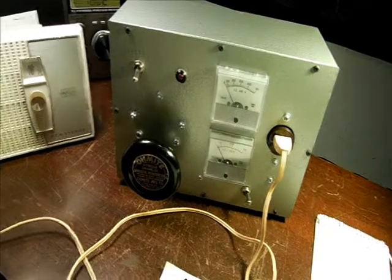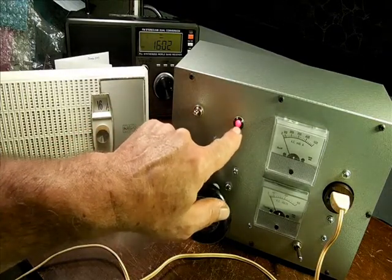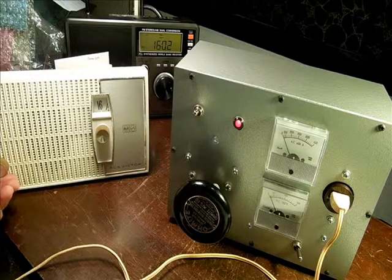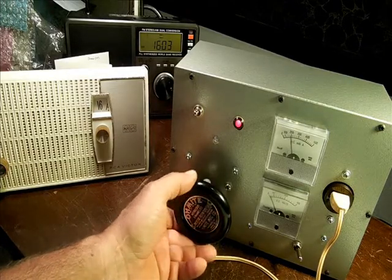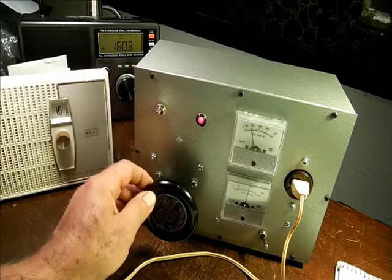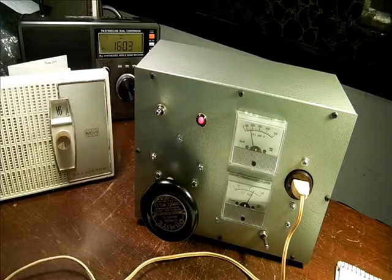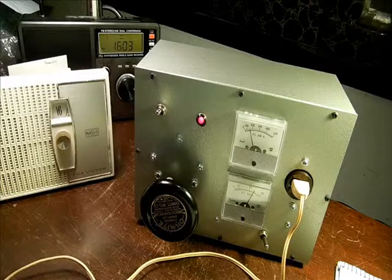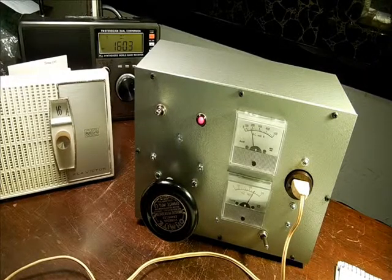I have a radio here, an RCA, and when that is on, it's telling me that the fuse is good and you're getting power to the 120 volt side of the variable transformer. Turn the radio on, and of course it would help to turn up some voltage. Let's see, we'll go up to 120. This voltmeter is actually pretty accurate. I was checking it out with a couple of different DMMs, and this radio here is supposed to draw 30 watts.